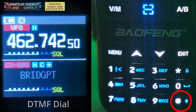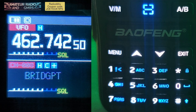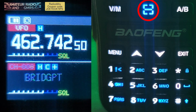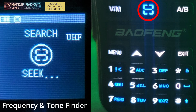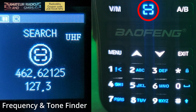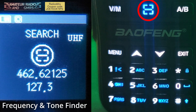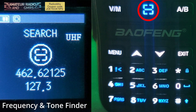Pretty sick, actually. All right, so now we're going to press and hold the middle button in the center — it's blue. This is a cool feature. This will find any frequency in the proximity of the radio, and find the frequency that it's on and the CTCSS or DCS tone that it's on. I'm going to transmit a radio in the background and show you what it can do. And it found the frequency and the tone that it was on. It's pretty cool.